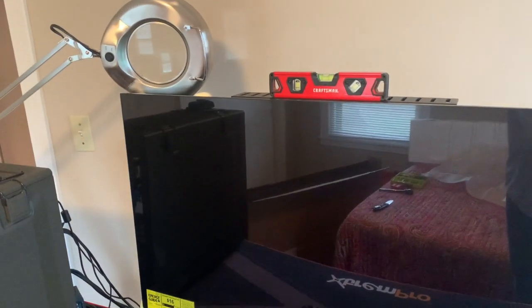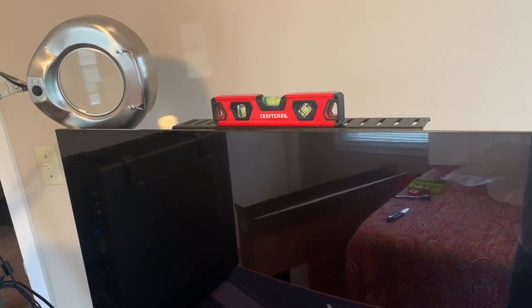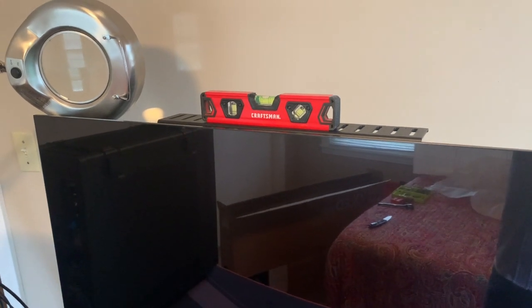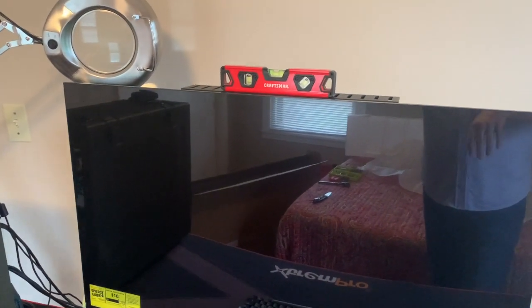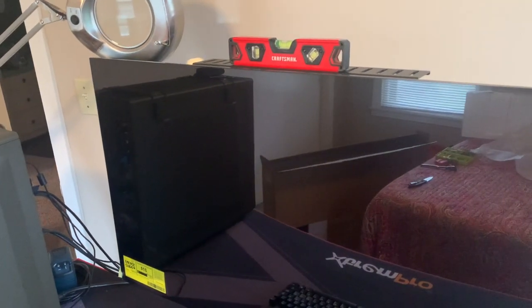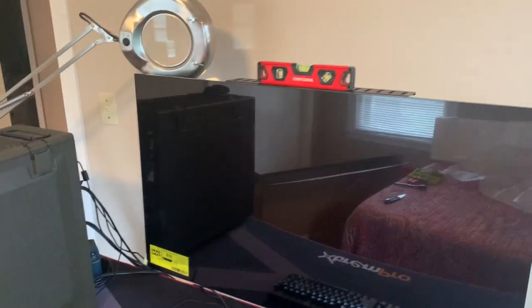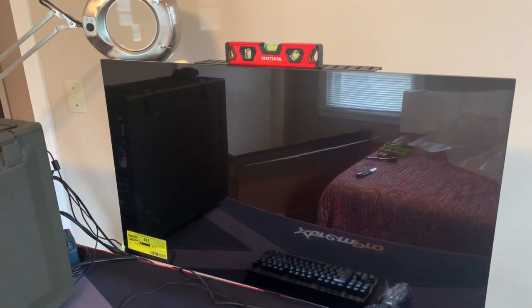A couple of key points: when you're building the VESA plates together, before you cover the TV with the VESA plate, you want to make sure you've got that little screw in the rotator plate, because you won't be able to do it later. There's really no tensioner on the rotation plate, so I just decided to lock mine into place. I'll link below for all the parts. My total investment was maybe $150, but totally worth it.